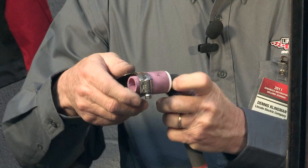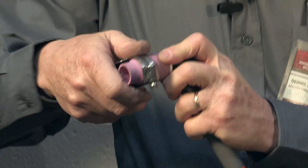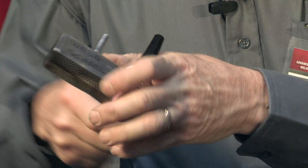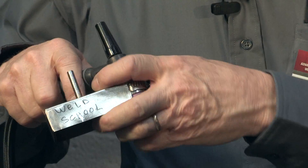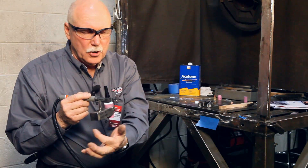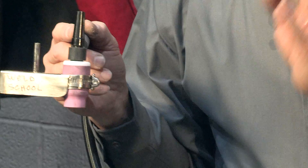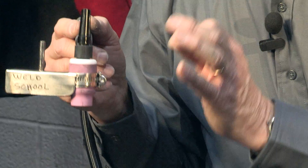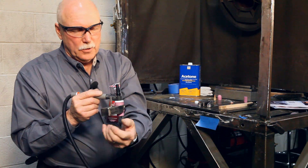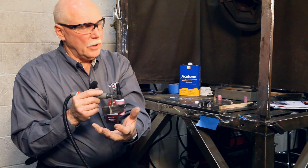This trailing purge is a stainless fabrication that fits in your torch, and it's universal. If you're right-handed, you put it on this side. If you're left-handed, you put it on the other side. This trailing purge allows for additional shielding behind you. By the time you move down the piece of material you're welding this far from the arc, it's cooled enough that it can be exposed to atmosphere and not react.